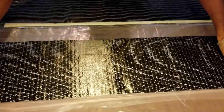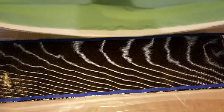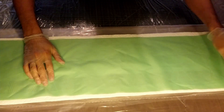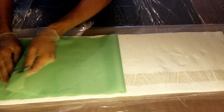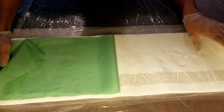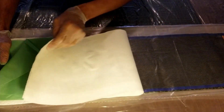The first step is going to be to lay these carbon fabrics down on the transfer layer, mix up some epoxy, and apply it with a squeegee. Then I'm going to transfer the layout onto the consumable materials, which in this case is a layer of peel ply — a special fabric that doesn't stick to epoxy so it can be removed after the epoxy is cured — and a breather layer to absorb excess resin and to allow air to flow inside the vacuum bag so that the vacuum pressure gets equally distributed. In this case, it's just paper towels.